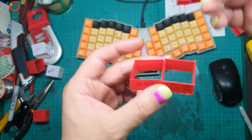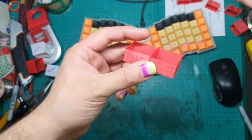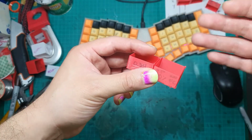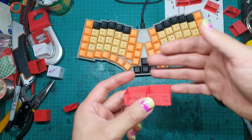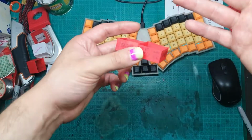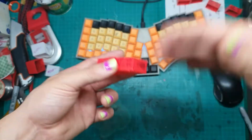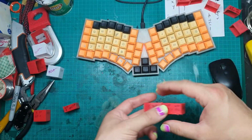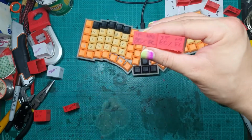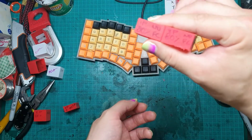And actually, many guides that tell you how to calibrate flow, for example Teaching Tech, an amazing guide, say that if you do this and you get a huge value and then you print something and you see under extrusion, then dismiss it. Just use 100%. I would assume they didn't know what was happening, and it's better to err on the side of, if it's so off and you're going to see under extrusion, maybe just leave it. Don't try to calibrate it, right? So I actually figured out that this is the setting that is causing these issues. It's not that the extrusion is off by 20%, by 30%, by whatever. It's that this setting is completely messing up the calibration of the flow.